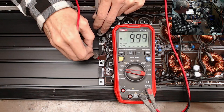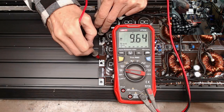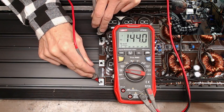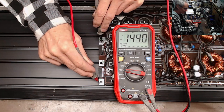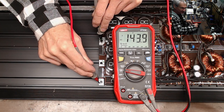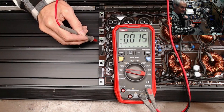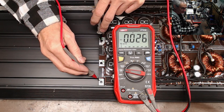Common to negative rail on the other side: 9.9 volts — looking good, safe around that. But positive rail — 144 volts, fully charged still. If you were to touch this positive rail and common with your fingers, you will have a bad day.